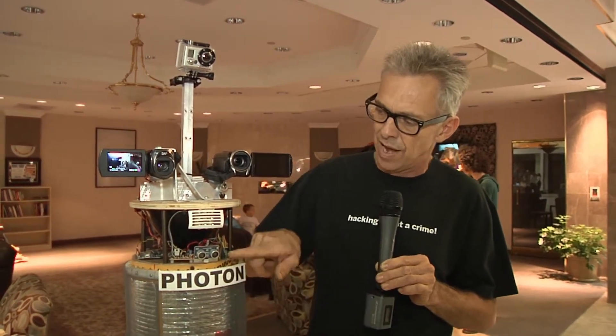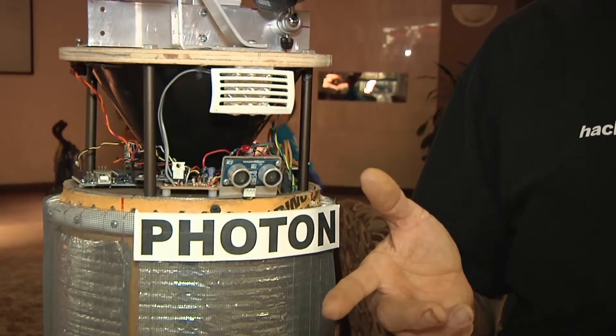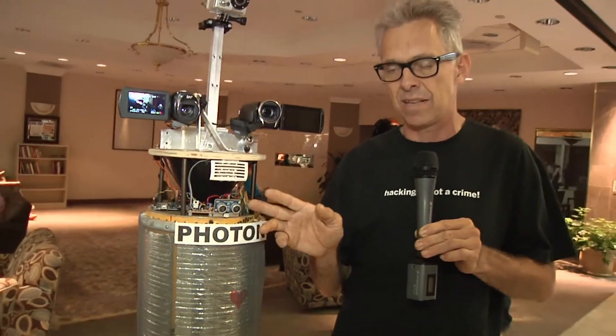The sensors on Photon include a ping ultrasonic sensor. This sends out an ultrasonic signal just like a bat would do, and it bounces back. When it bounces back, it picks up that signal and determines how far away an object is. Depending on what the code on the Arduino is written for, it will stay away from objects at a given distance — stopping, backing up, and turning the other way.